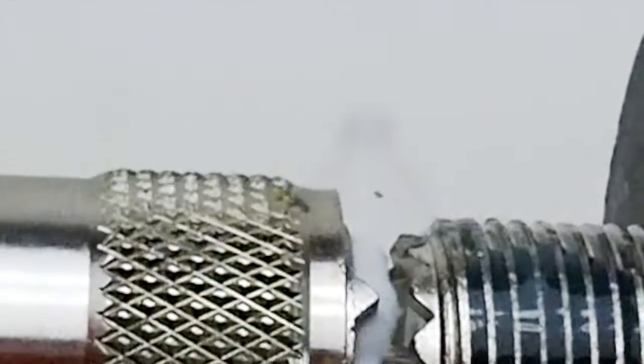Another thing you'll notice on these PL type connectors are these little teeth right here. These little teeth match up to this component right here, and it's always a very good idea to get those teeth locked into place. So I'll bring things together. Now I'm going to start screwing the head shell down, because I want to get all that foam to fill all the empty space in the connector. Okay, and I'll rotate the connector just a little bit to see if it's locked in place, which it has. Okay, I've got everything connected. And now you've literally created an almost waterproof seal.